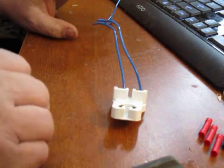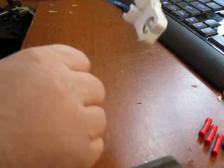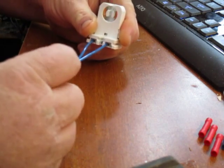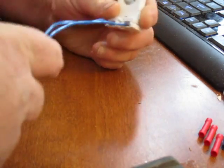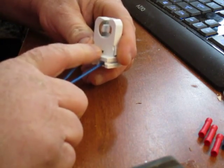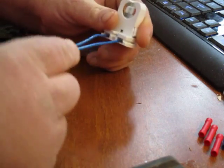You're going to remove your ballast and you're going to have these holders on both ends — you're going to have two of them, depending on if it's a one lamp, two lamp, or four lamp fixture. Now the ones furthest from your power cord, you're going to just cut them off or cut the wires, because these are basically called the tombstone — they just support the far end of the LED light.